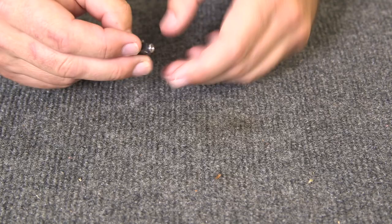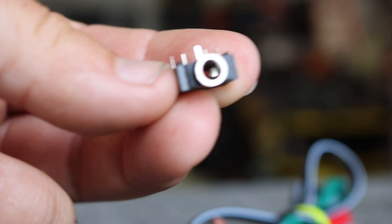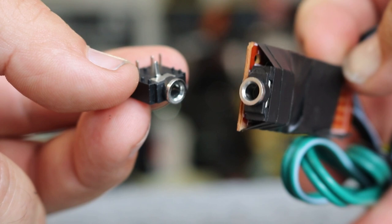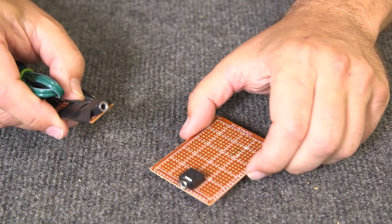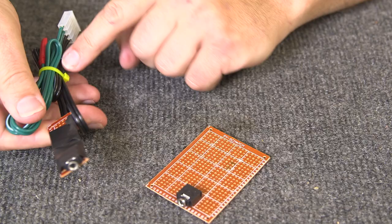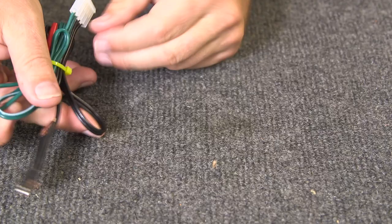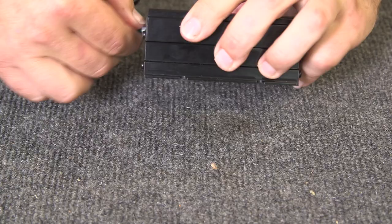I also need a connection for the speaker. Our speaker uses a mono eighth-inch connection, so I've got this little component, and that's a nice reason for having some perf board around because I can just mount it right to it — makes it a lot easier to do the connections. On the speaker wire out from the amp, I put one of those connections onto a little piece of perf board, soldered on the two wires from the amp output, and the back end just plugs into the amp.